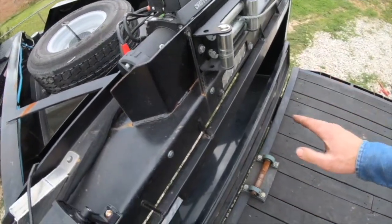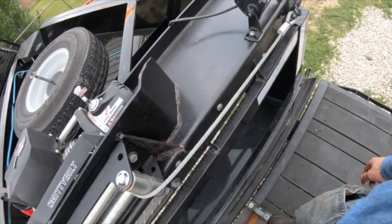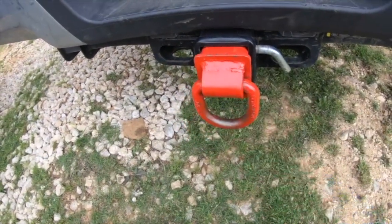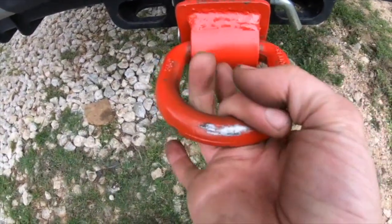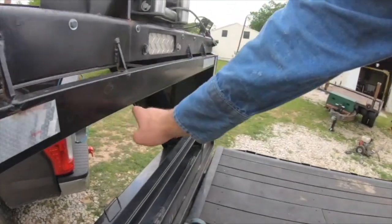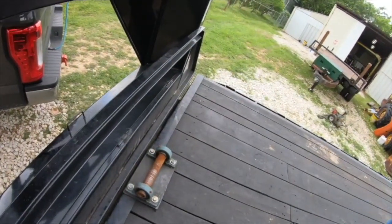The main thing I would do differently: I would build everything exactly the same — I really like the way this turned out. But there is one thing I'd change that I didn't think of when I built it. When running the winch cable doubled up — from the winch to whatever you're pulling through a pulley, and then back to double the pulling power — there's really nowhere to tie off the end of the cable on the trailer itself. We used a D-ring I'd welded up for pulling stuff out of the mud, and it worked, but it wasn't a perfect system. We would have been running the winch cable over a piece of channel iron, which damages the cable.